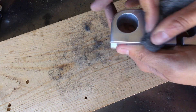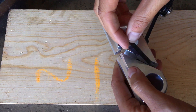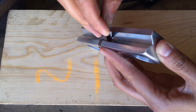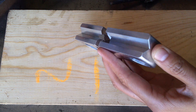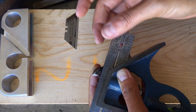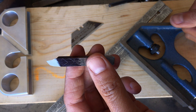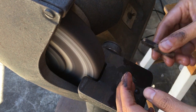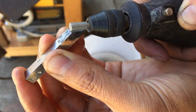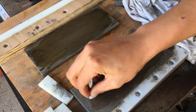And of course, just to make it all pretty, a little bit of steel wool. Now to the blade. I'm marking it here with Sharpie and razor blade. The blade itself is a quarter inch high speed steel bit that would normally be used on a lathe. This one is a leftover that was used on a lathe, which is why it has a funny shape ground into it already — so I have to grind that off. In between, I'm dipping the bit in water to keep it cool so that it stays hardened. The last step here is just to clean up all the bevels on some diamond sharpening stones. And I'm pretty happy with how that came out.